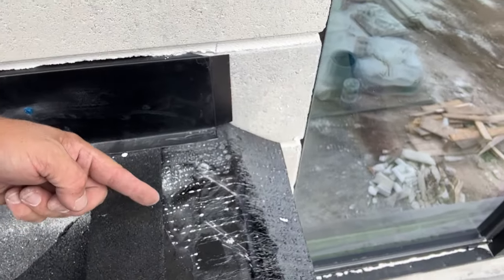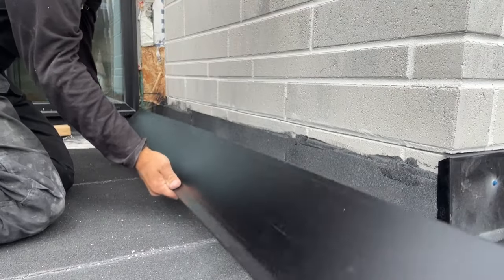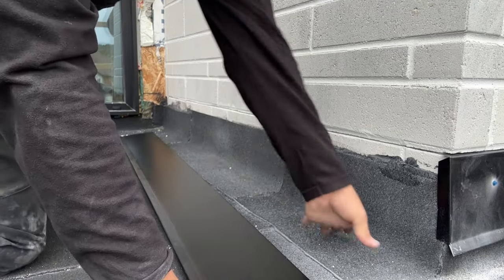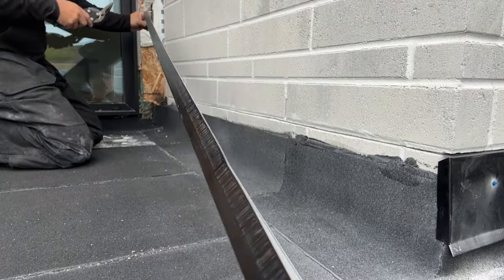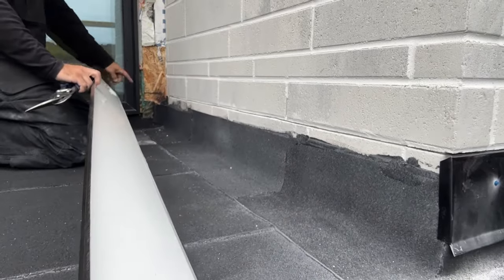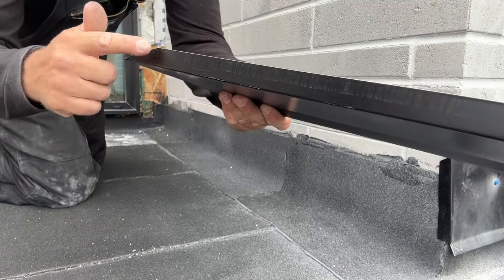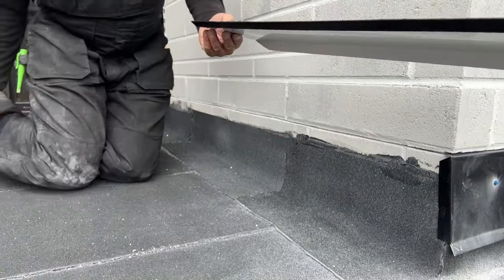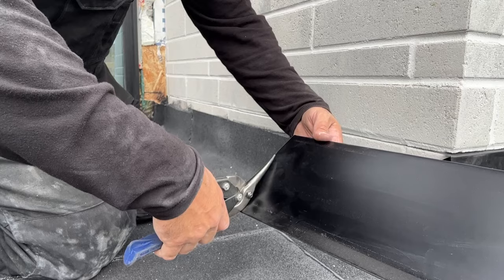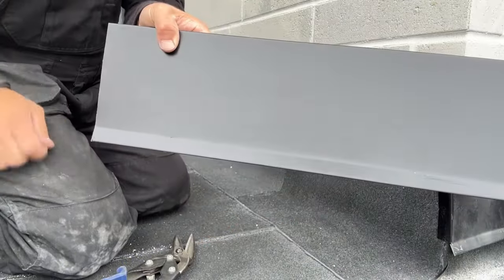Here's the tab that we left kicking forward, and this reaches the end — which is just how we wanted it. Since we're doing this all in one piece, we're going to start in this far corner and make sure it's nice and tight. I'm going to miter the top return that goes into the reglet because the blade could not reach all the way down — so this is the relief cut, we just miter it down on an angle down to nothing. Also, because of our base, we're just going to take an inch off the bottom down to nothing at the top, because with our flashings it makes a little bit of an angle in that corner, so we have it a little bit on a bevel.